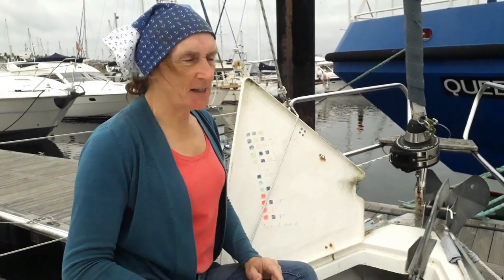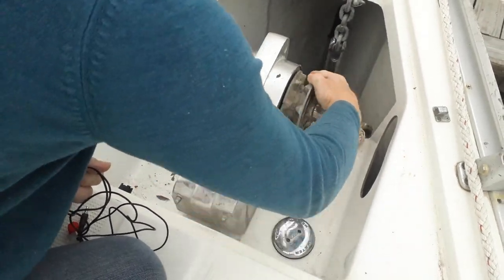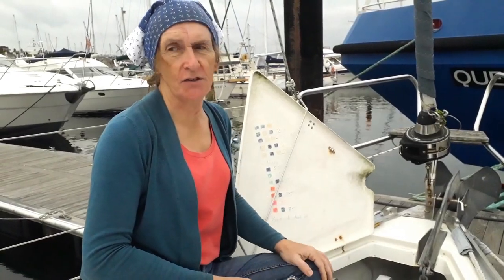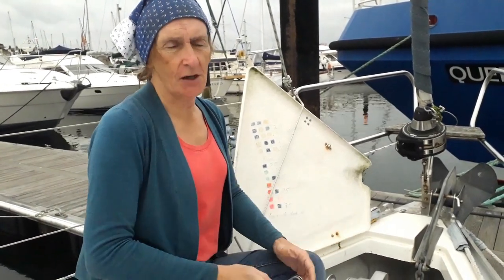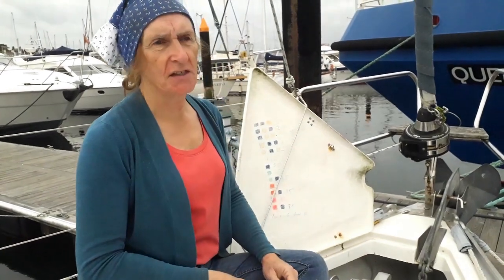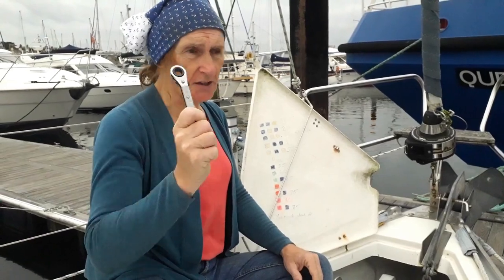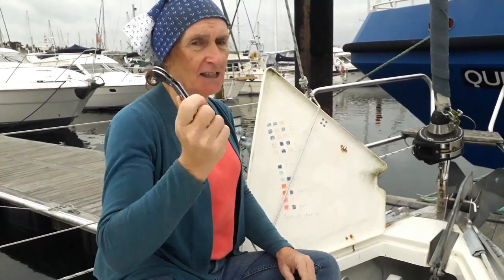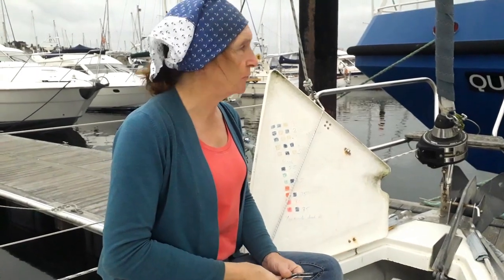The first thing I've done is I've released the manual clutch and the gypsy. While it's all screwed down to the deck there's quite a bit of force needed, so it's easier to do it while it's all screwed down than trying to hold it still below decks while one of us twists and the other turns. The gypsy is now loose so we can take it off easily. The next job is to lift the whole unit out and for that I need a 13mm spanner — I've got a ratcheting spanner to make the job easier.